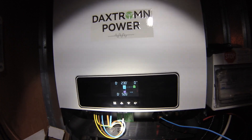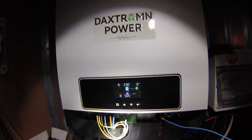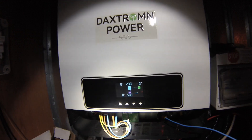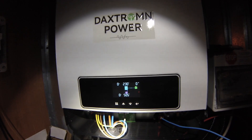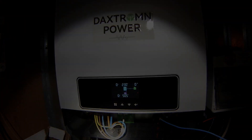At night with no sun it will stay at 30 amps, but as soon as there's a little bit of sun that enables the MPPT, it will actually overload the generator. A couple of ways to get around this is to set solar priority or solar charging only for the batteries.